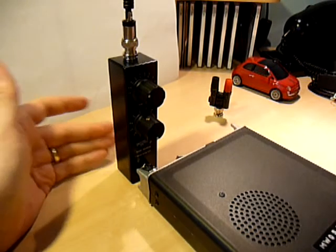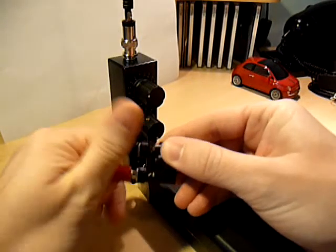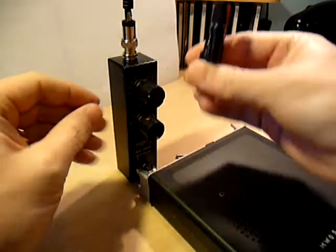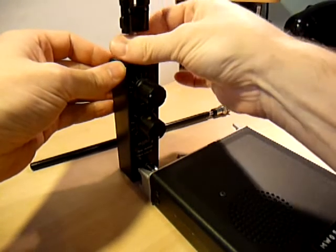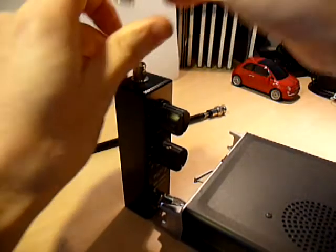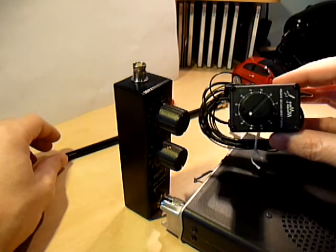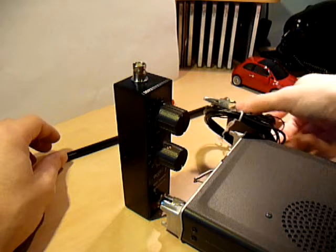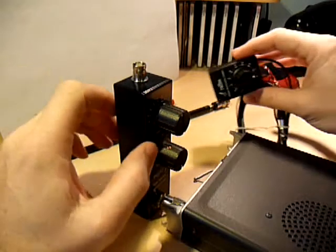It fits straight in the back and away you go. It comes with a banana-style BNC connector with two terminals. If you want to use wire antennas you can get rid of the whip — you can put any short whip in the top and that will match. So you can put a wire dipole in there. Also there's one of the tunable counterpoises, which has a long length of cable that connects to the chassis and you select the inductance. Made by the same company.